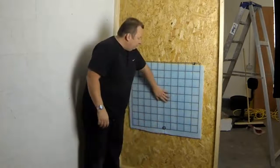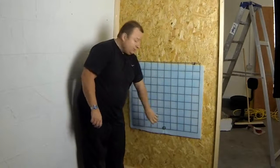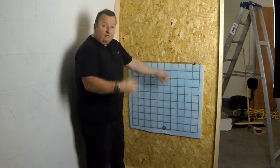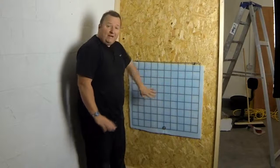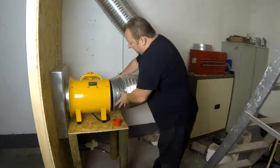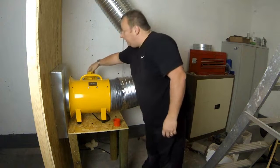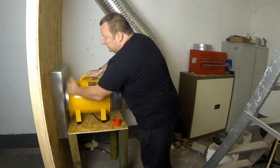There's our grille now in — it's only in temporary at the moment. I'm going to put proper hooks up here and also a proper cleat down there where we can just do it in one turn. As you can see, that's our external filter membrane inside the booth now — and we buy that on a big roll. When we get our carbon filter, that will just sit in the back there in the actual box area. So basically all we've got to do is cleat that onto there, drill through and fix it. We can turn our fan on and off from there, which isn't a problem. And I'm also going to install some sealant around here.